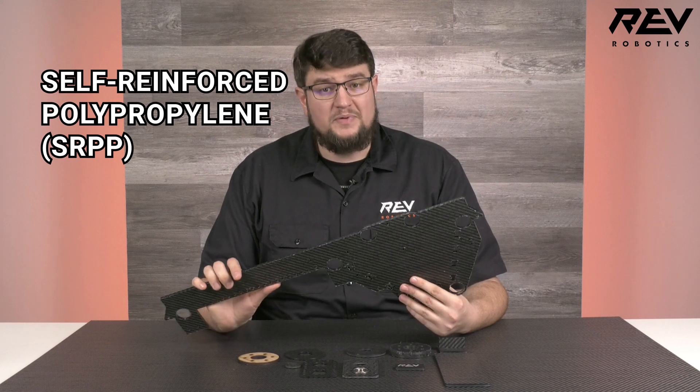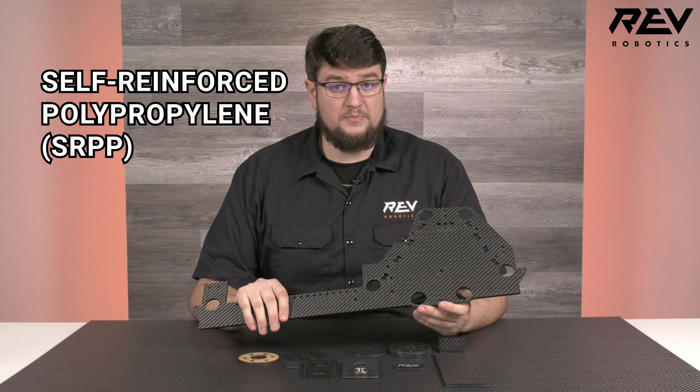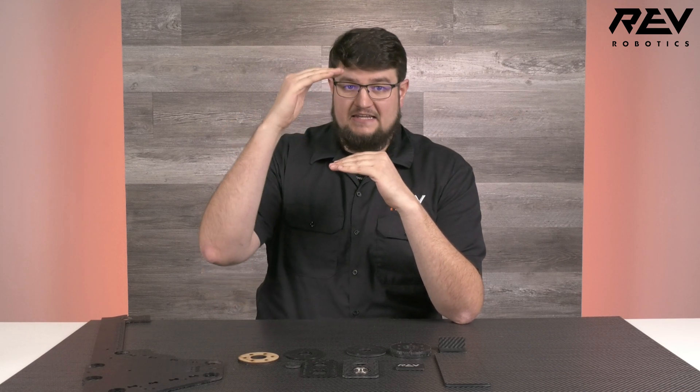What is Max Composite? Max Composite is made from self-reinforced polypropylene, SRPP, a pure thermoplastic material that combines two molecular weights of polypropylene with different melting points. During production, polymer chains are stretched and aligned into individual sheets, which are then stacked and heat-pressed under precisely controlled temperature, time, and pressure. This process bonds only the lower melting point polypropylene, forming a matrix that secures the unmelted fibers — hence the term self-reinforced.